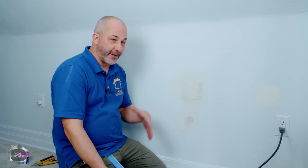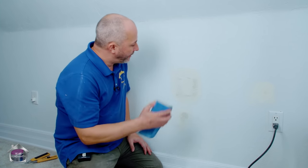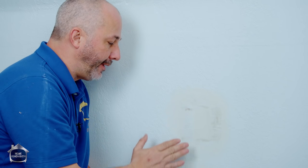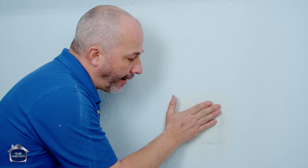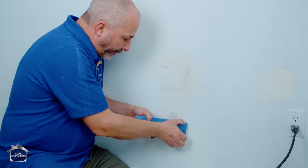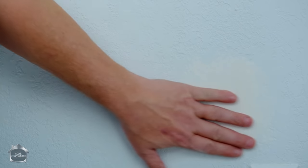We're back. Unlike traditional patches on a smooth wall where you can stretch mud over a large area, when dealing with texture you've got to keep it right and tight. We're going to gently sand back all of our ridges back to our original dimension. We want to be working with the closest possible thickness of this wall. Using a sponge it can sand into the texture, so feel free to sand extra material out of the texture around the patch.